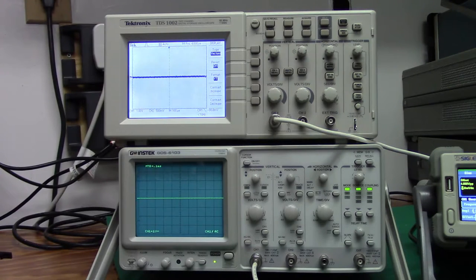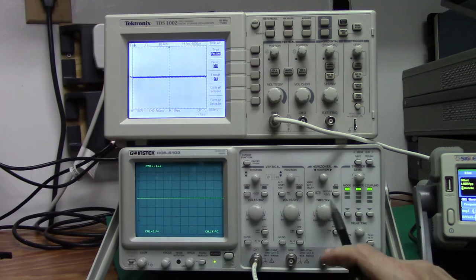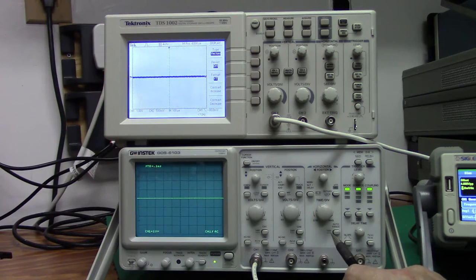All oscilloscopes, despite variations in how they acquire signal, whether it's digitally or in an analog format, will function the same way and have generally the same control blocks. All oscilloscopes have, as a minimum, three control blocks, usually on the front of the scope, and then they'll have one or two hidden blocks. We can look at all scopes as universally having a volts division or a vertical control block. All oscilloscopes will have that.